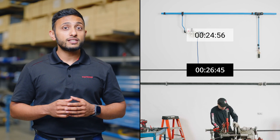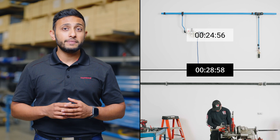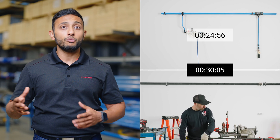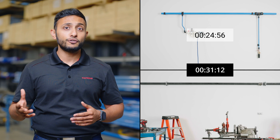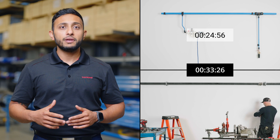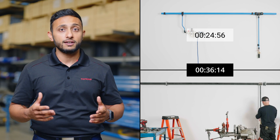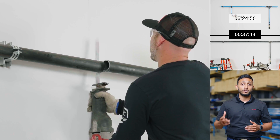While we were talking about the first two steps, the installation of the aluminum system was completed in just 25 minutes, while the steel mounting had just begun. Unfortunately for our installer, he's far from finished with the steel system, because he's about to begin one of the most common modifications to a piping system for compressed air — namely, the addition of a drop.